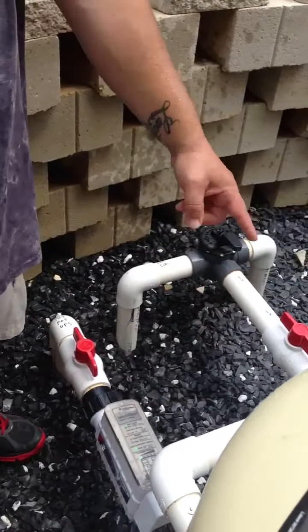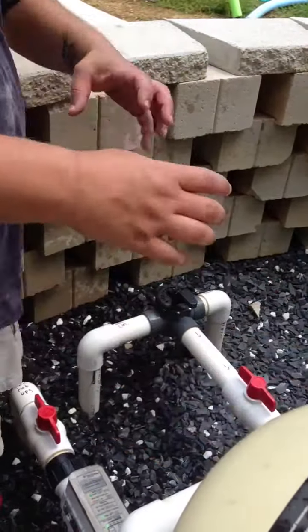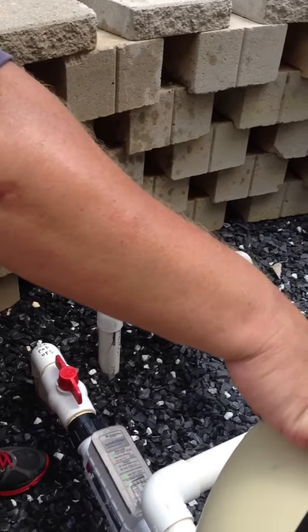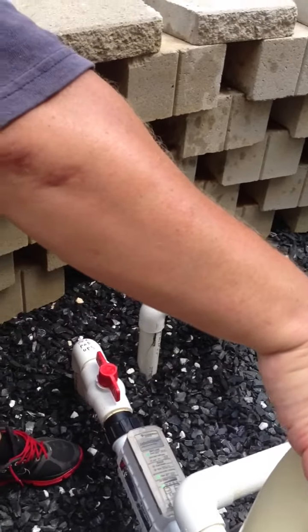The one this morning — they shut it off. Literally this whole piece, which is a threaded piece, had blown straight out. Think about the pressure you create to rip threads out. That would ruin their system. It can cause a lot of problems — not only your plumbing, but your motor and your filter. It can become pretty expensive.